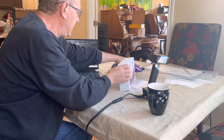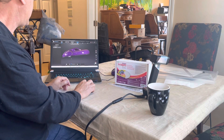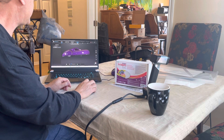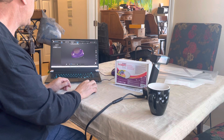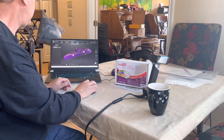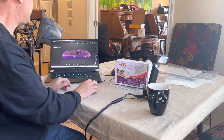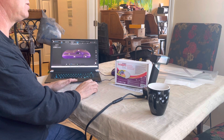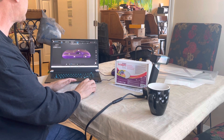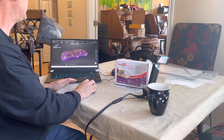When I first scanned it, you could actually read the label off the box, but I didn't need the box so I deleted it. Another advantage of having it on the box was there was a thin space where the wheels were between the body, so by carefully trimming that out I got a relatively good edge. My plan — which I'll discuss with Charlie — would be to 3D print this whole body or the pieces to make molds. He doesn't have a printer large enough for the whole body, but he has one that does a 2-foot by 2-foot by 4-foot block, so we'd do it in blocks, assemble the blocks, make molds off the blocks, and then make parts off the molds.